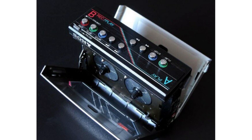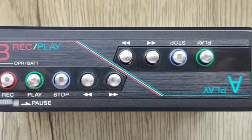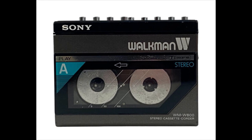It may seem that a lot of complex engineering went into this particular device, but it was basically just two WM-10 mechanisms mounted back to back. The recording deck required an erase head, and this was achieved by making the record/playback head half the normal size and mounting a small permanent magnet ahead of it. The magnet was only engaged whenever it was in recording mode.